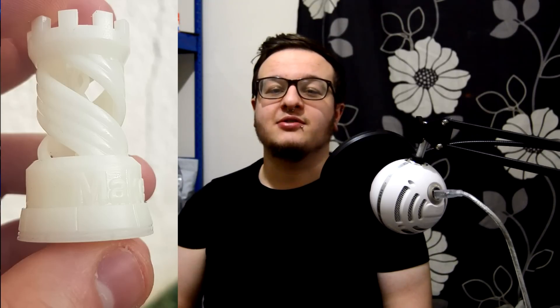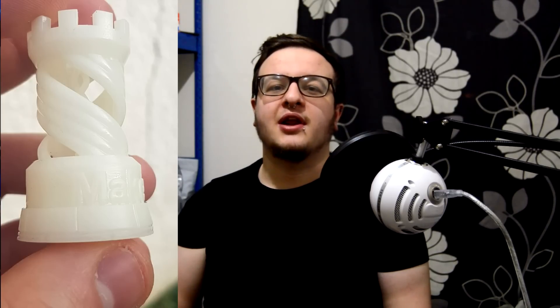I'm going to be posting a video on the initial setup of the printer soon. But for now, I know you guys want to see updates on how it actually prints. With the time taking so long, I wanted to start off with some smaller, less complicated parts just to see what the printer could produce. I printed one of the Maker Rooks, the little chess piece, to compare to the Formlabs Form 2 resin print that I had in hand. As you can see here, the quality is just outstanding. This is printed at 100 micron layer height.